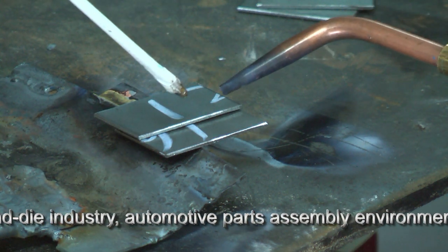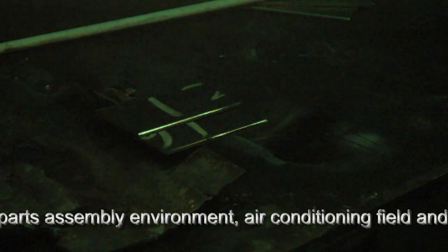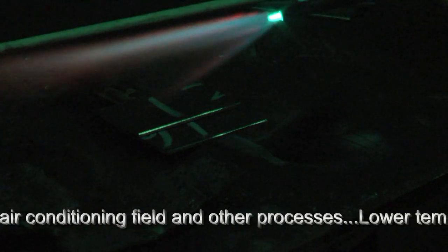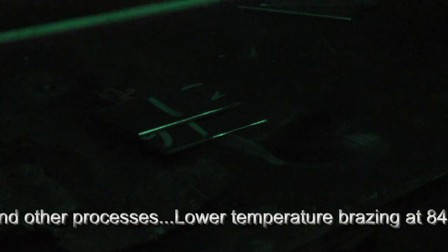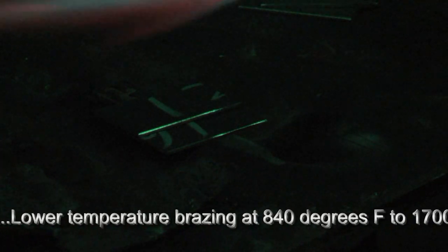It's kind of an awkward angle for me, but a better way for you to see it. I'll demonstrate a lap on this side, then turn the piece over and complete the lap on the other side. The objective with brazing is not like welding — we want a slight carburizing or soft flame. We're going to introduce the oxygen and make the cone a little bit soft, keeping the torch slightly away from the metal. The goal is not to fuse these metals together, but to heat them to the point of being wet, and when they have that wet look, we'll introduce the brazing rod.